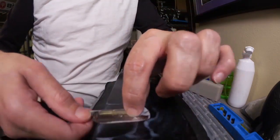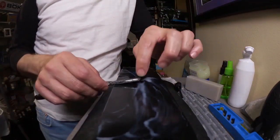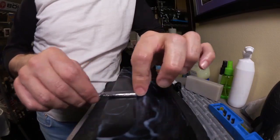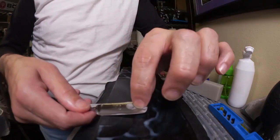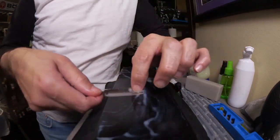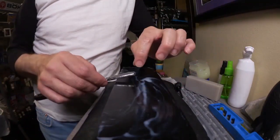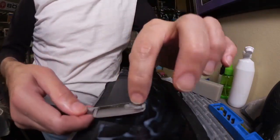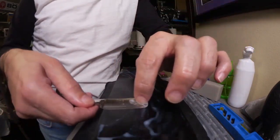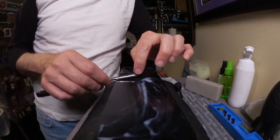In the history that I've researched, it does say that a truly expert grinder would only use a very small wheel. And in fact, I have read of a book from 1809, from England, that says a grinder would use one wheel that was just 7 inches in diameter. Imagine that, just 7 inches. So you can't have a 7-inch diameter expressed as your cutting edge for the entire length of the bevel. That would just break apart like a dandelion. That's too damn thin. So what did they do?